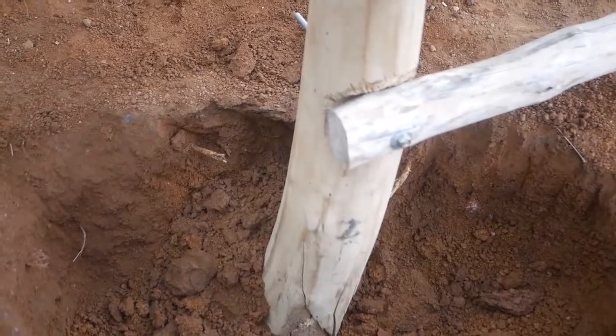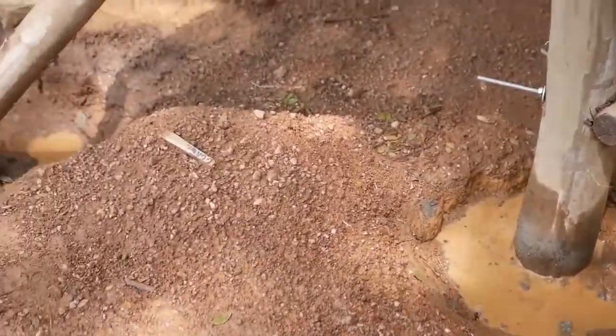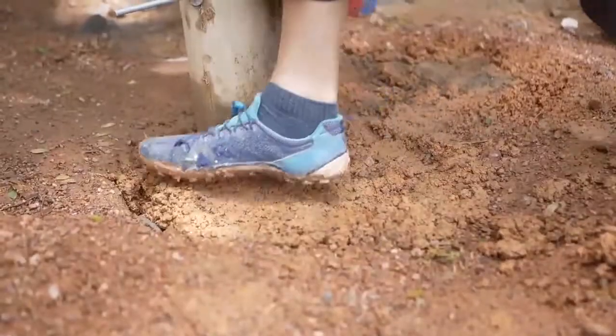You may need to make some adjustments to some of your holes when you're digging. You can get a rough idea when you put the basic frame together, but then things may change when you're building the rest of it. So we're just having to make some slight adjustments here to get these posts cemented in place. We're going to use cement going about 40 centimetres deep to make sure it's a really strong connection.